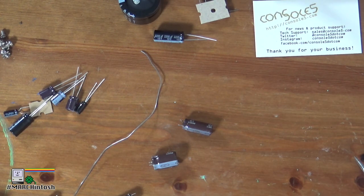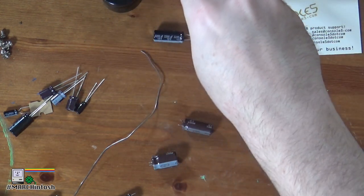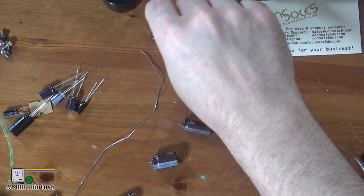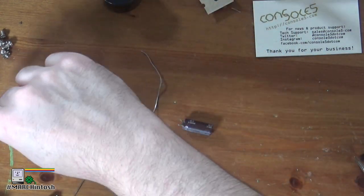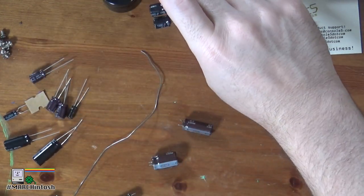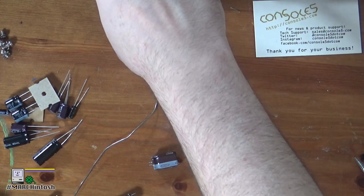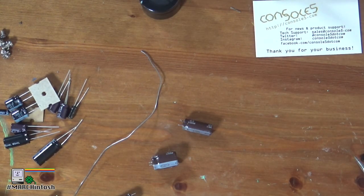So I now have a full capacitor list of what I need. Of those, I have the 180 microfarad for C8. But I won't actually need a 2200, and I don't need the two 1000s either. The only capacitor in the kit that matched what I need is this big one. The kit did say it was for a Dynacomp power supply, so I should have believed it.